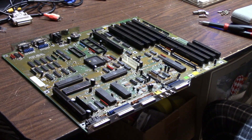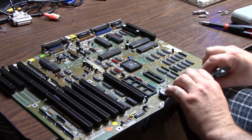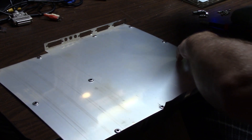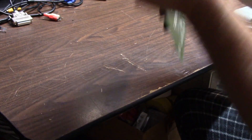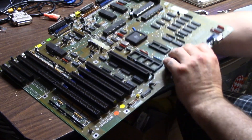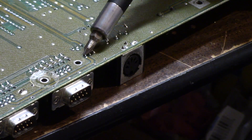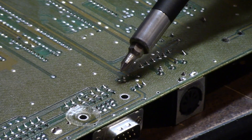Here's the board in its glory — recapped, new axials, everything is fine. To get the case off we have to remove this, pop these out ever so carefully, and then you can lift up. There is a plastic membrane underneath to protect the metal — don't lose that. There's also several plastic round ends on the bottom of the board. What we're looking for is F1 — right here. We're going to be removing this and getting the soldering station fired up.